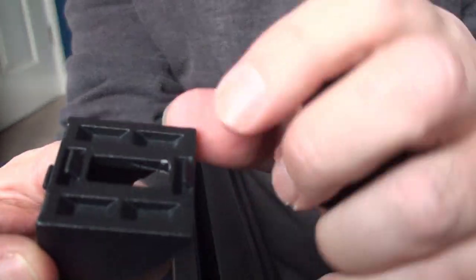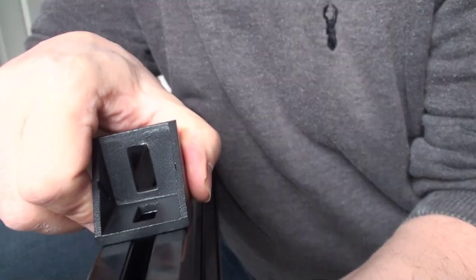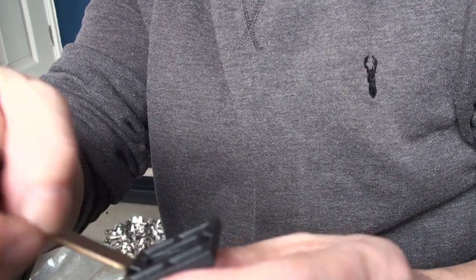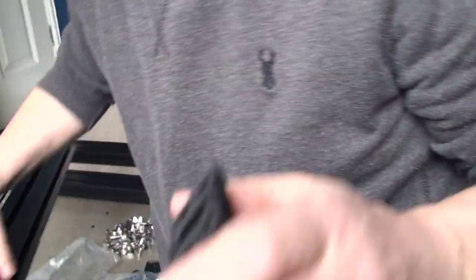With these parts you've got these two lugs sitting up, one on each side, and those lugs sit in the groove - so it stops it from moving around, you can slide it but you can't actually move it sideways. However, because these parts fit angularly you're not going to be able to fit it this way. On one side you leave them attached, and on the other side what you do is put the wrench in, lever it up, and you literally just snap them off so it's flush. That then means that when you're offering it up to the metalwork, it will sit flush.